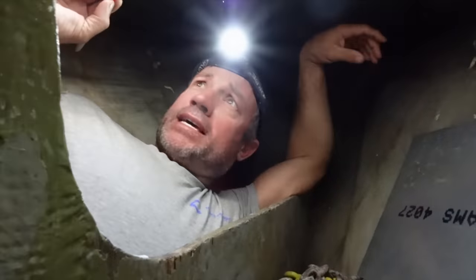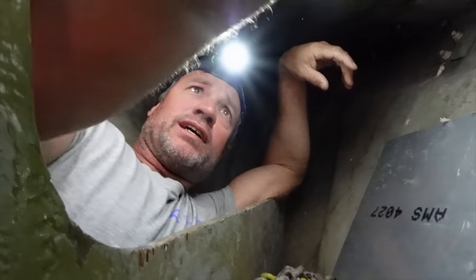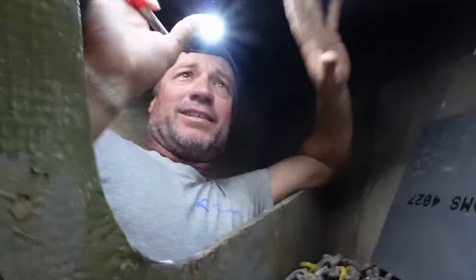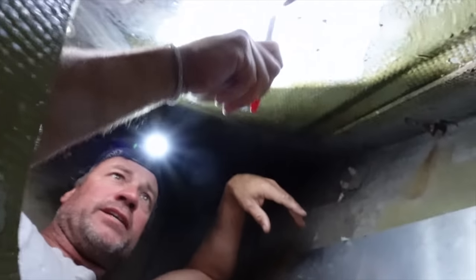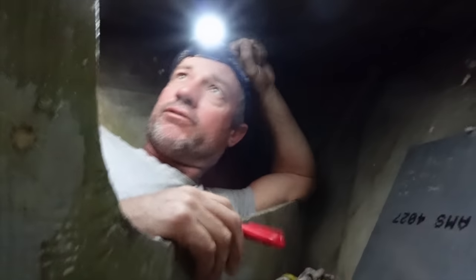Cleaned up this mess in here. Like I said, it's got all plates cut into here that I've fiberglassed in. It looks what it looks like at the moment. I'm not going to sand and make anything look finished. It's an anchor locker, but it's sealed up, that's the main thing. It's solid glass, all these penetrations now through here have all been oversized, re-drilled out, they're epoxy straight through. So if water leaks, it's not gonna go into any of the core, it's all sealed up.